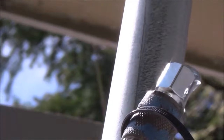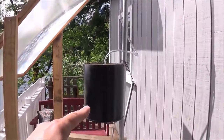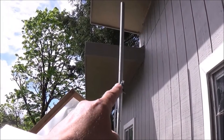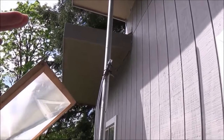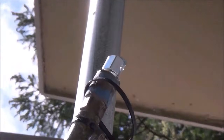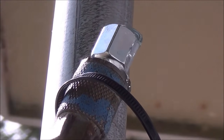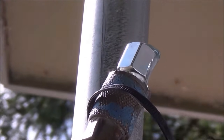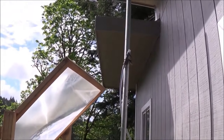That would be filling another one of these pump tanks — so that would basically go into another one of these with another Fresnel lens up here at 96 inches. That could fill up once again, with another Fresnel lens heating it on the other side of the cycle, pumping it even further uphill. And the whole time I'm talking, it's just blowing out water. It's a working thermodynamic, or thermal evacuated, water pump — until next time.